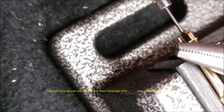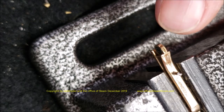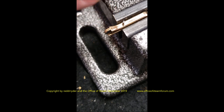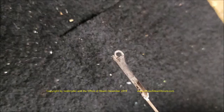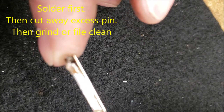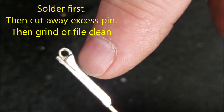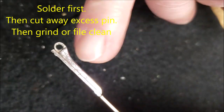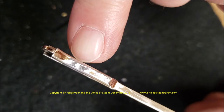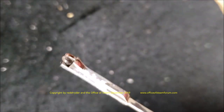I'll keep a little pressure on it here — I think that's got it. For the next step I may try to put a drop of solder there to hold it in place; glue might work also. We're about done with this project. All I have to do is put the glasses back together. I trimmed off as much as I could with a cutter, then used the diamond dust grinding wheel on the Dremel tool and took it down where it's clean and smooth. You can see right there where the hole is and the end of the pin, and I put a drop of solder on it.